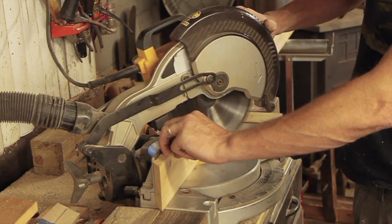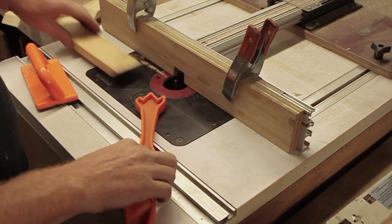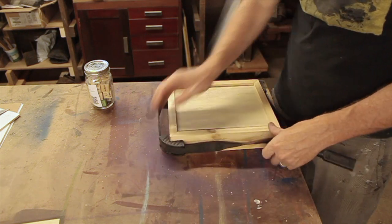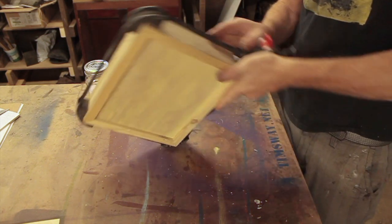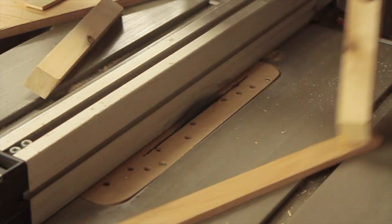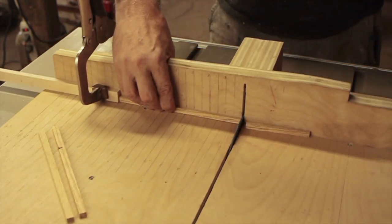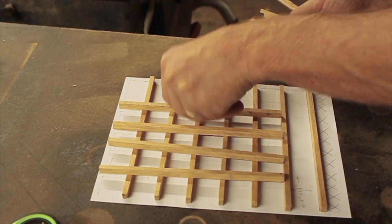I had pieces of reclaimed cedar three-quarter inch left over — it's not the best wood because it's kind of soft, but I was just using what I had on hand, still experimenting with the design. I simply mitered them, routed a slot for the quarter-inch plywood, and clamped the miter together with the quarter-inch plywood floating inside the slots. While that was drying I found some scrap oak and cut these quarter-inch by eighth-inch pieces. You can read the plans for the exact dimensions. This is the layout template that shows what the inside of the game board looks like.